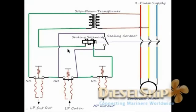So now let's understand during normal operation the suction pressure and the discharge pressure are all normal, and let's see how the compressor works. When I put on the main breaker, which is in the switchboard, the supply comes here, and this suction pressure is okay. This is the low pressure side, so the suction pressure is okay. Through this bellow, the suction pressure acts on this link and keeps this link closed against the spring pressure over here. So this contact remains closed.